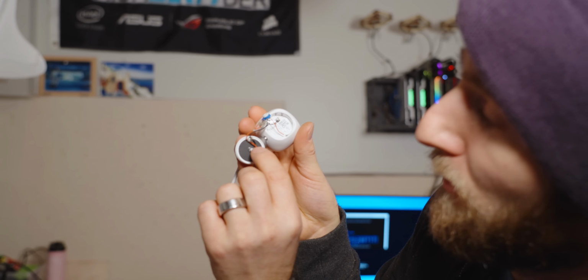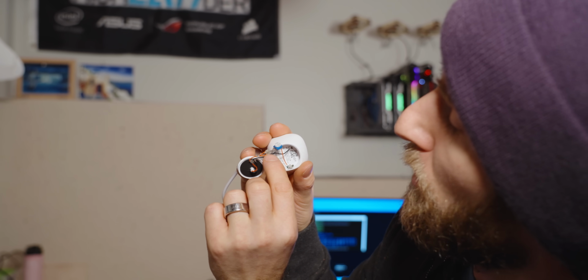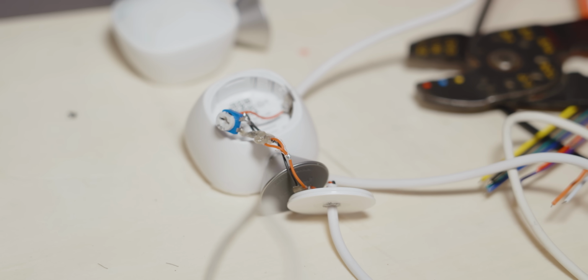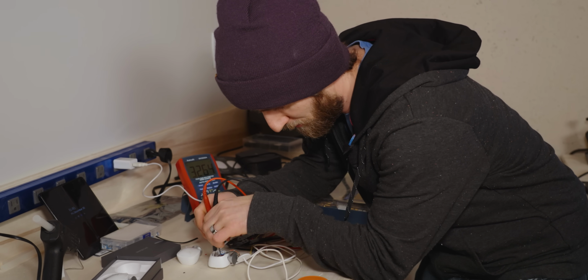Our red and black cables go into a Y splitter and directly into our potentiometer respectively. It goes out into our 3.3 volt regulator, and then we just need to dial in the pot to make sure that the voltages going out to our ecobee smart sensor are exactly 3.2 volts. So let's just go ahead and double check that. 3.26, okay, well, we'll need to adjust that.